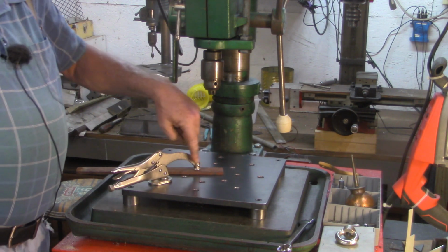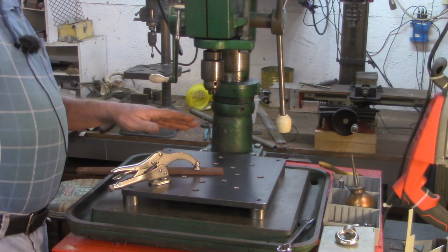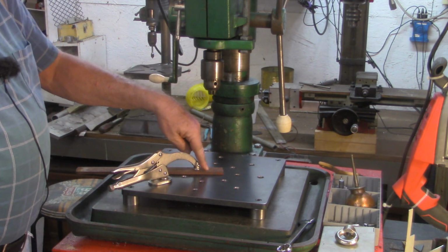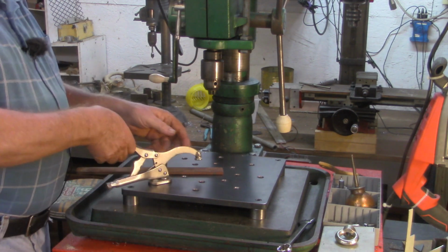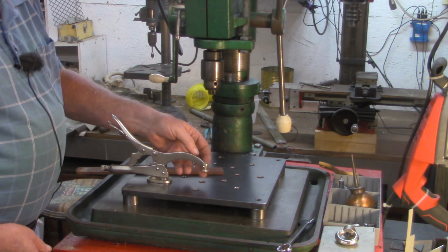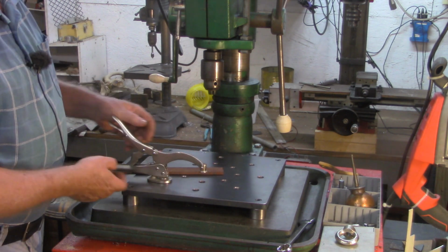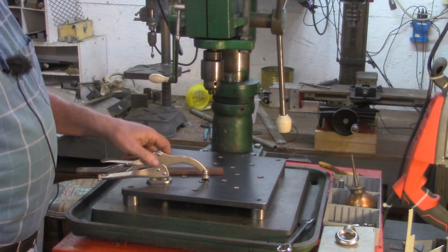Now this particular clamp, I don't know whether it's sprung, whether it's bent, but it has a 1/4 inch clearance. This is screwed all the way in now, and it will not clamp anything any thinner than 1/4 inch. So what I may do, if that's the case next time I pick up one, I may weld just a small little, about 1/4 inch plate on this existing foot here, and then that way I could clamp very thin material if necessary.